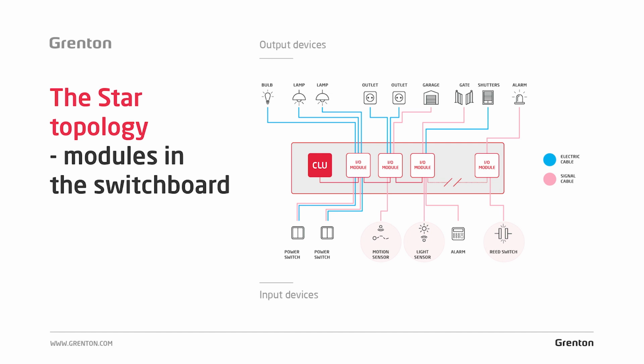The issue of sensors, i.e. contactors, motion sensors, or any other detectors that return a value in the form of 0 or 1, have a relay or short to ground. The cable is led directly from the switchboard to each of the sensors separately. What kind of wire will it be? Some manufacturers recommend not using twisted wires on the sensor side, so you should be careful here to verify and check.